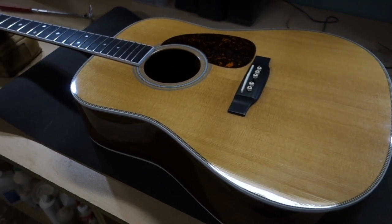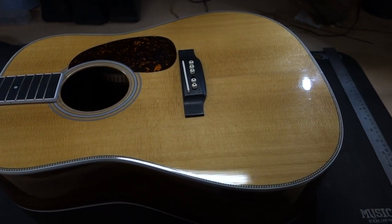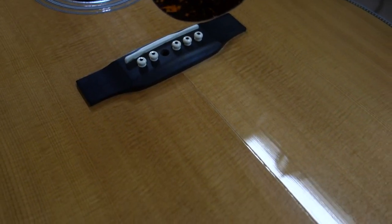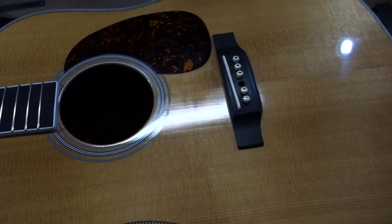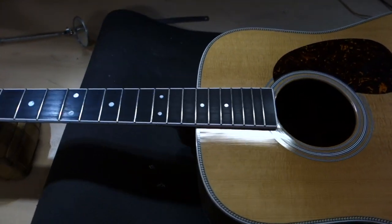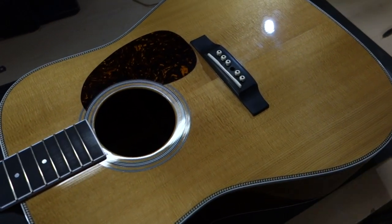What I have on my bench here is a Martin HD-35 that just came in and it is suffering from some dryness damage. The obvious thing is this crack here on the top — I actually repaired this back in the summer, but the guitar has dried out a lot and the crack has reappeared. There are also some other signs of dryness, and I want to point out the things you should be looking for — obvious signs that you need to start humidifying your guitar right away.